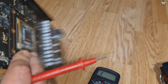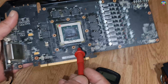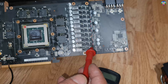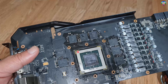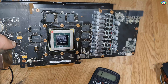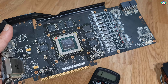Here's what the card looks like from the back. I did not find any other shorts except in those MOSFETs. I have already tested the fuses — the fuses are fine. Everything else looks fine: the 5-volt supply is coming through and all the 12-volt lines are present as well. I have no idea why, even though those MOSFETs are short, it's not showing a short at the connector area. The card is also not showing any display on the computer. That's all for today — wait for Part Two, and please like the video and subscribe to the channel. Thank you very much, goodbye.